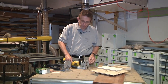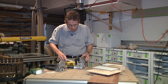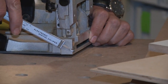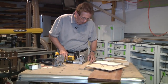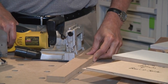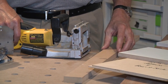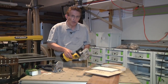In the case of the biscuit joiner, the saw blade is centered on this red line, which is 3/8 inch above the tabletop. So if I was going to do a 3/4 inch piece of work, I want to approach it like so — I'm going to be close enough to the center line that I'm basically there. Remember, you don't have to be in perfect center with any of these machines. You just have to be indexed correctly, similarly with the pieces you're joining.